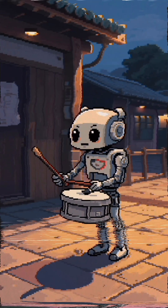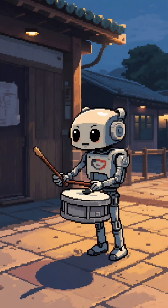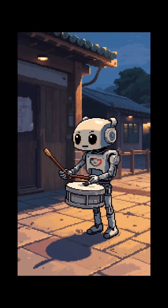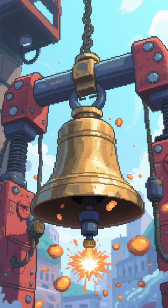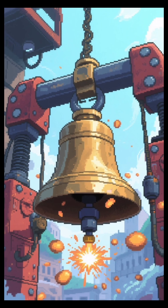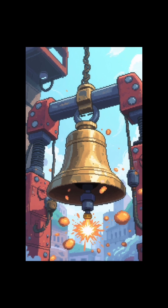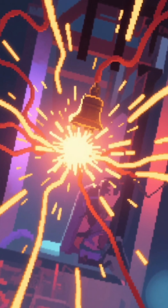The bell's ringing noise is created by a metal striker that repeatedly hits the bell. Let's imagine this striker as a little drummer, eagerly waiting to play. When the electricity passes through the coil, the electromagnet pulls the striker toward itself, making it hit the bell. This drumming also breaks the circuit, causing the magnet to switch off.